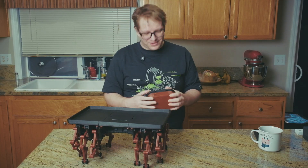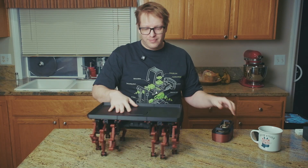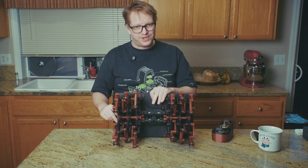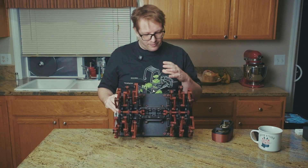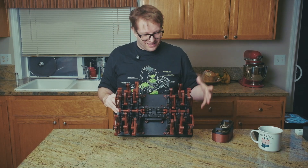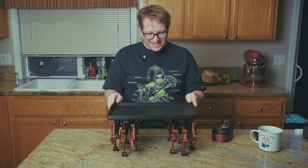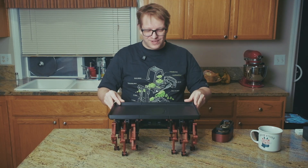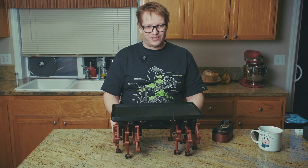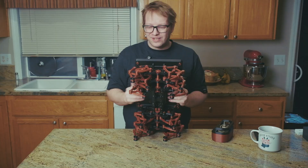It's a little loud, but it is a cool project. Like I mentioned, because there is a lot of mechanisms here, there's a lot of chance for friction, which can be a lot on the motors. I'm using a 1-to-105 gear ratio in here, which gives a lot more torque, but it can still stall out depending on how you push it. Going forwards and backwards isn't necessarily the problem — it's when you start turning that it puts a lot of extra forces on those legs.